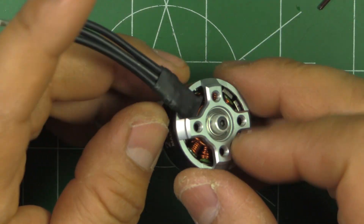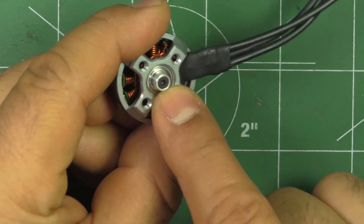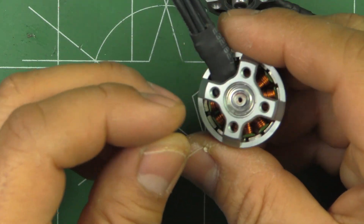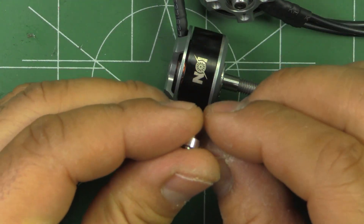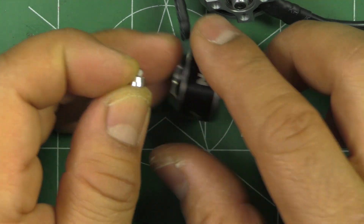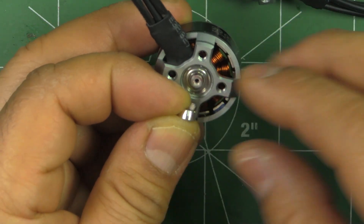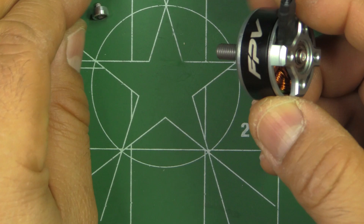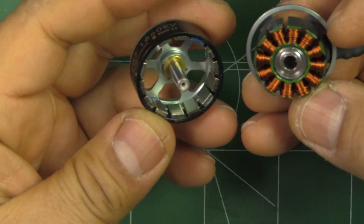It's single strand wire. I'm going to disassemble it and get it on the magnifying glass for a closer look. The retaining screw — they do Loctite it pretty well using that white Loctite, which is a pain to remove. I already removed it on the 1660 kV version. This Loctite dries up pretty well, so you have to use a soldering iron and leave it there for like 10 minutes, and it's still kind of hard to remove. You need a really good Allen key and do it carefully so you don't round the head of the screw. Once removed, the motor comes apart fairly easily.